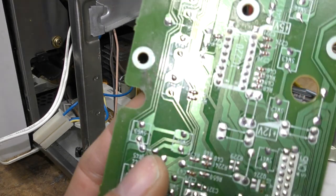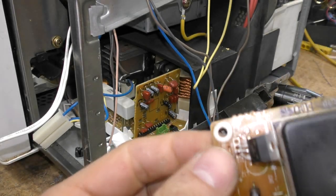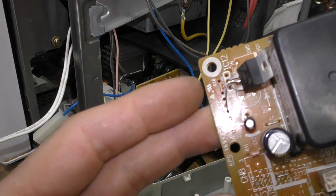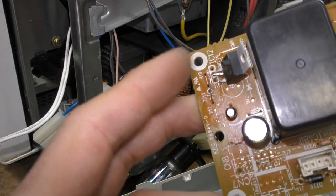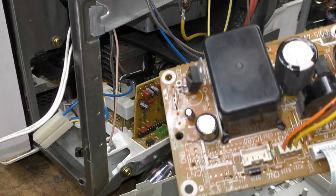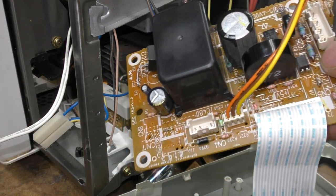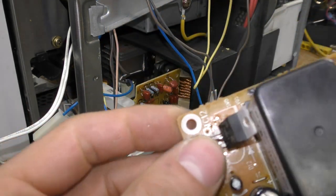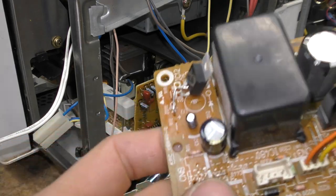The second fault I found was a transistor that was a 5-volt regulator. I just replaced that with a 7805 to get 5 volts in there. When I was testing it, the main symptom was the 5-volt rail wasn't there. There's a little 5-volt transistor — I couldn't be bothered to figure out exactly what transistor that was, so I just whacked a 7805 in there.